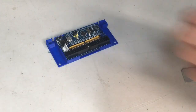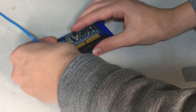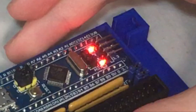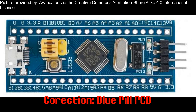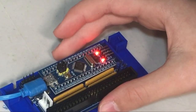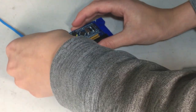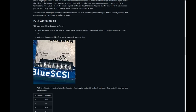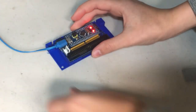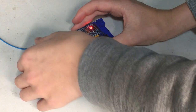Now that the Blue Scuzzy is fully assembled, I want to plug it in and make sure it works — issues during assembly may only show up once it's fully assembled. Plugging in micro USB power to the microcontroller, I can see a few lights on top. The first is the power LED. The second, labeled PC13 on the PCB, is used to indicate what the Blue Scuzzy is doing. In my case, the LED flashed five times on power-up, which according to the GitHub repository means the SD card cannot be found — a good sign that the device powered up successfully and is functioning.